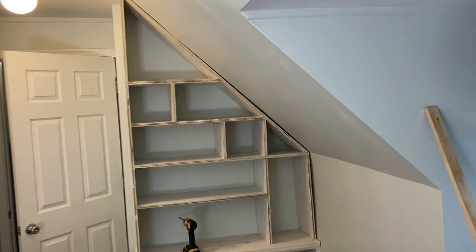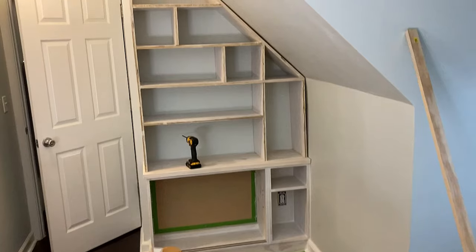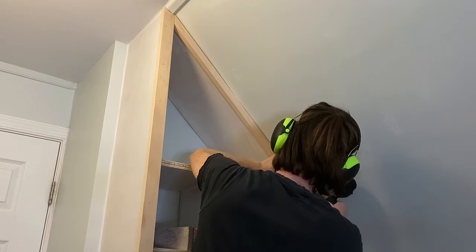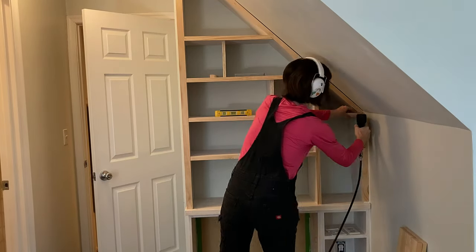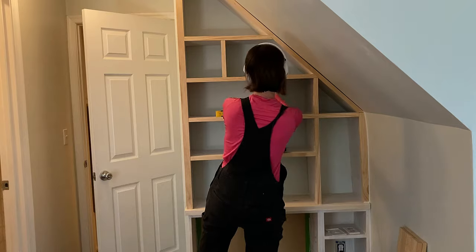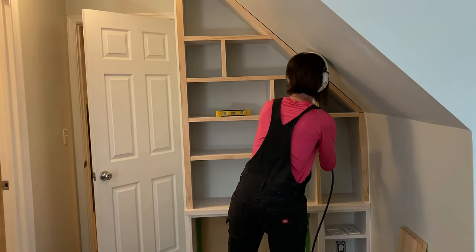Last, I connected the bookshelf section to the base with pocket holes that I pre-drilled on the outside vertical pieces, then attached it to the studs with a scrap piece of wood added just above the top shelf on the bookcase. Everything was super secure and tucked nicely into the angled corner. I ripped down 1x6 pine trim into different widths — the outside vertical trim is 1.5 inches, the angled trim is 1.25 inches, the inside vertical is 2 inches so I could scribe it to the wavy inner corner, and all of the shelves and dividers are 1 inch. I did each piece one at a time, figuring out the width based on the last piece. I used a level and a square to line up all of my trim pieces, then attached them with 18-gauge brad nails.